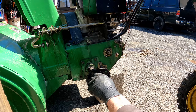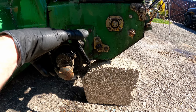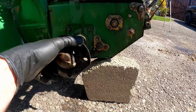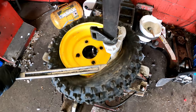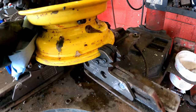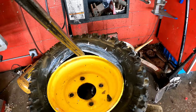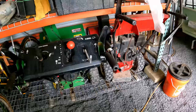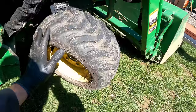Oh, look at that. It's got an open differential. I wondered what that little pin is. It's so if you're on a driveway and you don't want to have to fight with turning it, you leave this popped out and then it's an open diff. That, I'm definitely keeping this unit. This is way better than what I have. Now, look at that. Fits perfect in there. Dueling snowblowers.